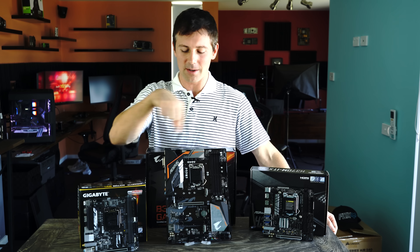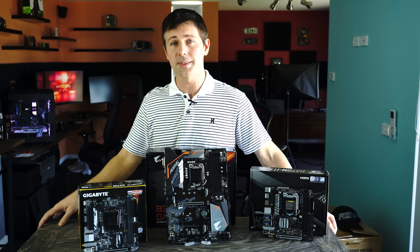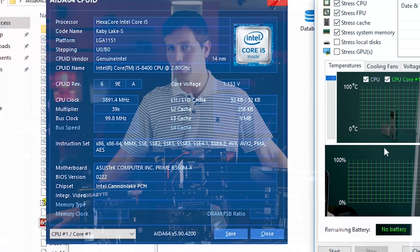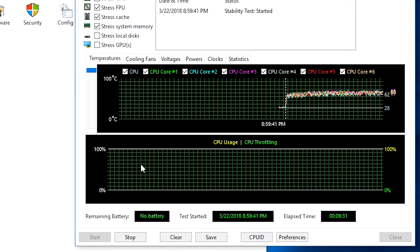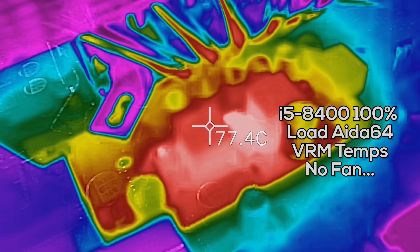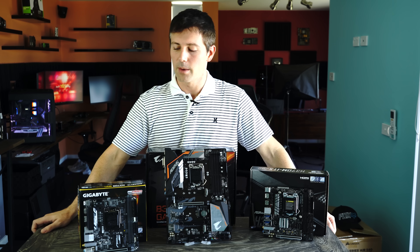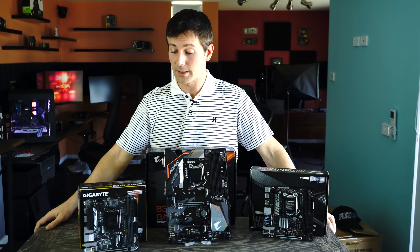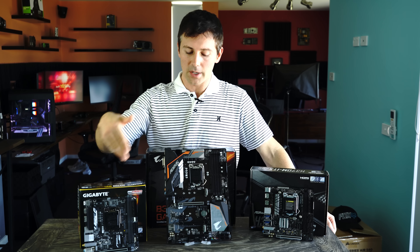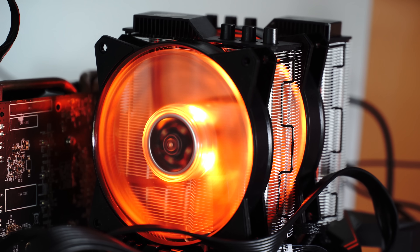Welcome back to Tech Yes City. This is Brian. I previously took a look at the B360M Prime Series from ASUS — the VRM was getting a little bit hot and I unfortunately couldn't test my 8700K on that board. I'm going to get another 8700K retail sample and try that out. My engineering sample did work on all these boards, and they were drawing over 100 watts on the CPU alone. So if the VRM can handle it on the 8700K, it can handle any other 8th Gen Coffee Lake SKU.